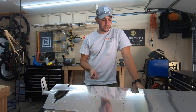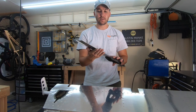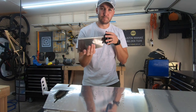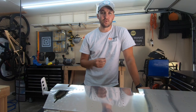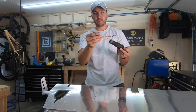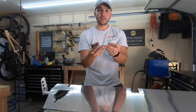Just a quick recap on what I would not do again: don't use a really fine-tooth saw blade — it gets really hot and hard to use. A standard hand saw was also too fine a tooth profile; it just gets stuck rather than cutting through. I would use an aggressive tooth bandsaw to cut down the side profiles, a Sawzall to cut off that top portion, then come back with the chisel for precise control on larger chunks, and a small file just to finish the small spots.